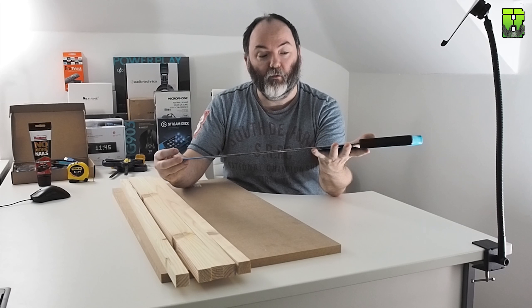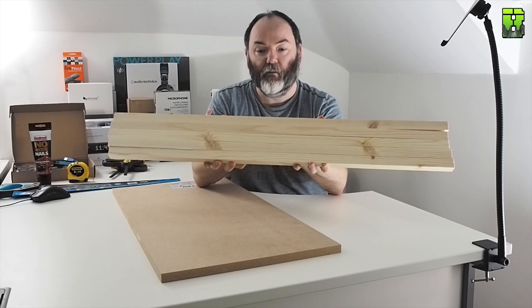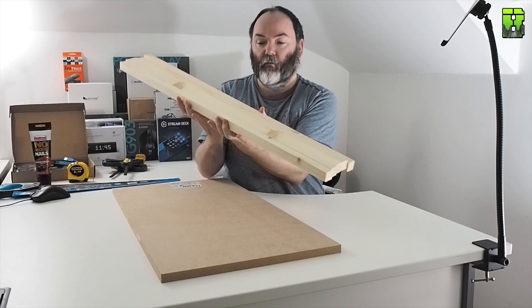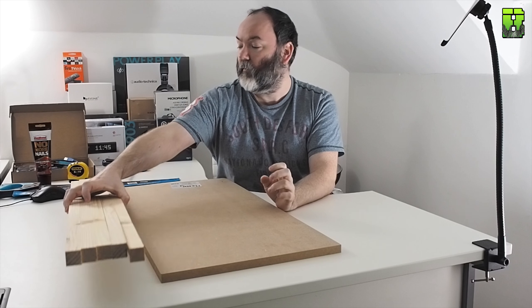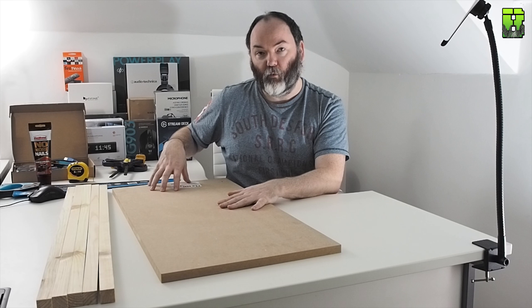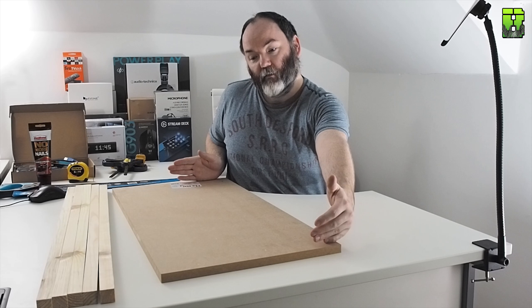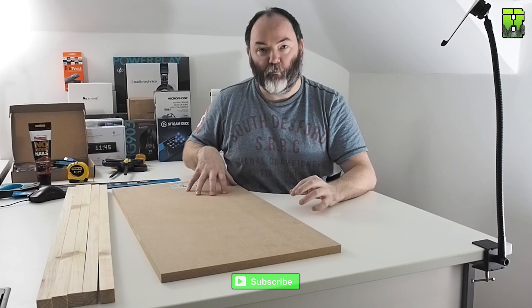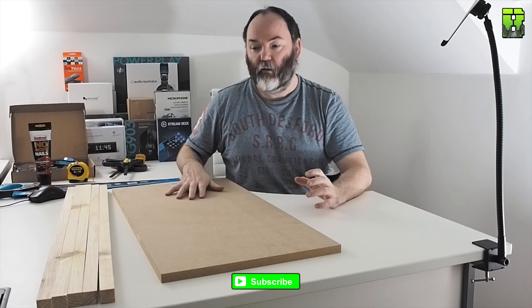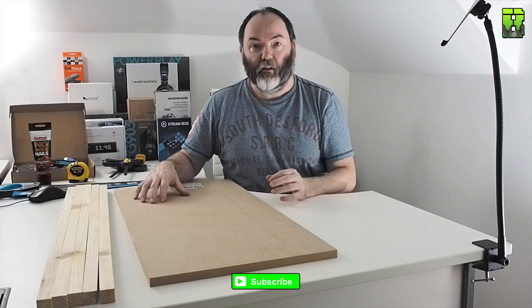One saw — just a normal wood saw, not too expensive. I've got five of those 25mm by 25mm by 900mm pieces of wood; I might not use all of them. I've bought a few extra just in case. I've also got the base, which is an 18mm MDF board, 405mm in width and 510mm in length. I've seen some people use pine or shelves, and some people build rigs without a base — I just like having a base. So let's get on with it.